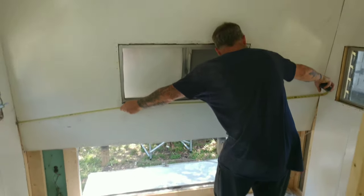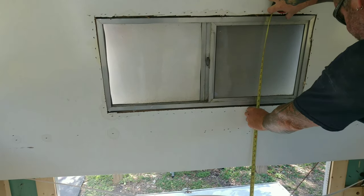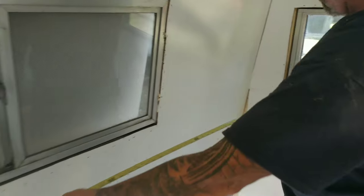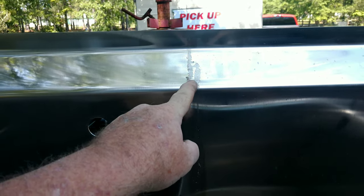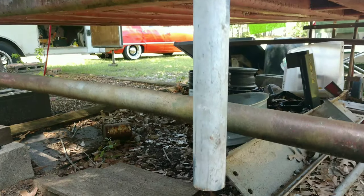We were getting ready to install the sink. One issue we ran into was the sink was going to come right to the middle of the window, and obviously we don't want that. So what we're going to do is center the three-compartment sink a little bit off to the right, and we'll cut out this area and bend it down to a 90-degree angle, because the top part has to be sealed to the wall for DHEC. Also, the legs were already welded on, so we'll have to cut about two inches off of those.